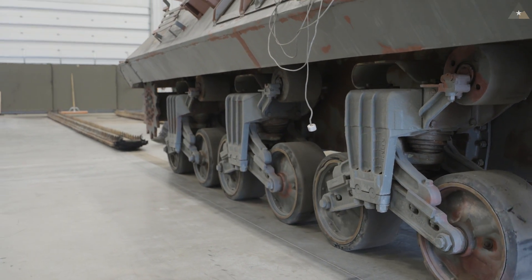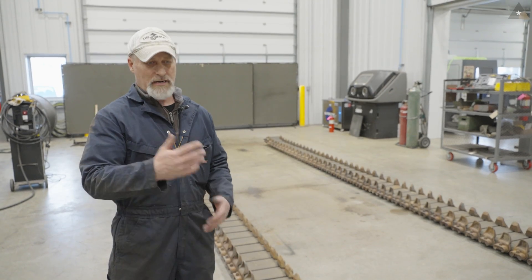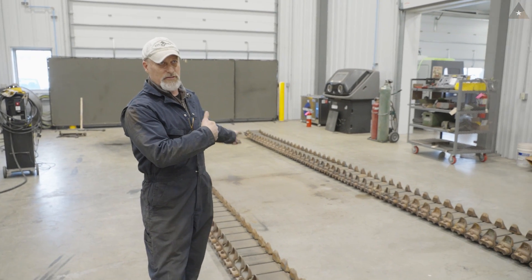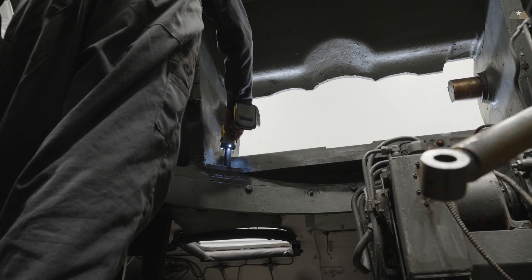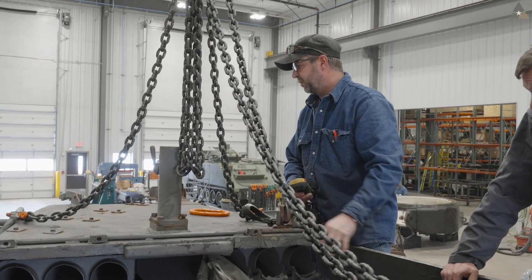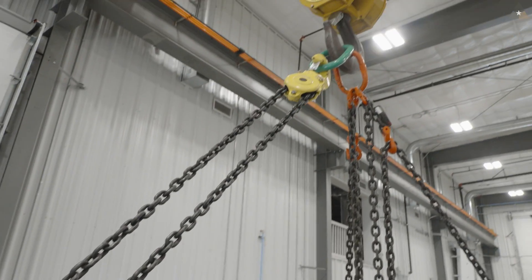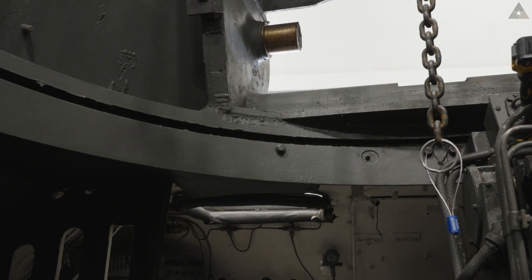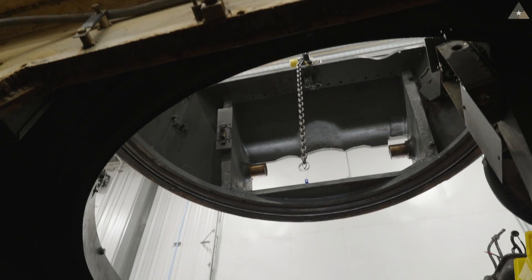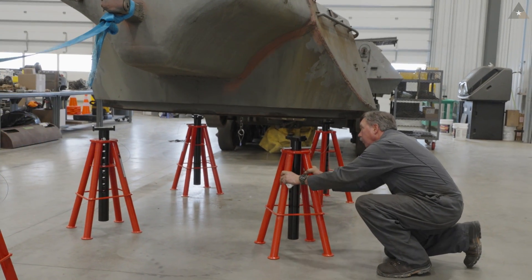What we're going to do now is clean up the area, but first we're going to section these tracks into probably four to six pieces so we can pile them up on the forklift and manage them. Next, we're going to move over to our tank, back in its original position, and pull the piece parts out of the inside and then pull the whole turret off of it. The trick to getting the turret off is keeping it level for safety. We kept it straight by using the extra come-along to adjust the level as needed. After the turret was free, we placed it on jack stands until we're ready for the next process. If you want to catch the next video on the project, hit the subscribe button and the bell — we'll try to have the next video in the series up in a few weeks.